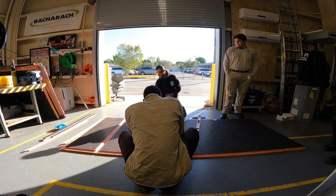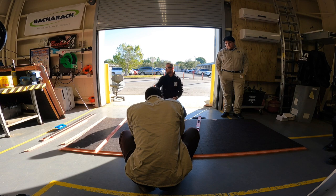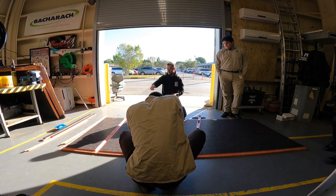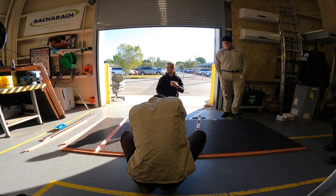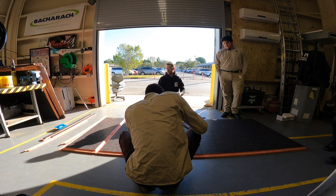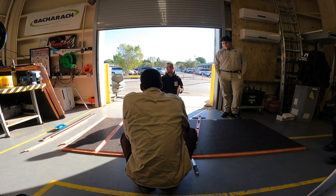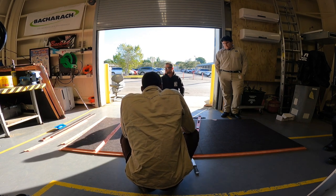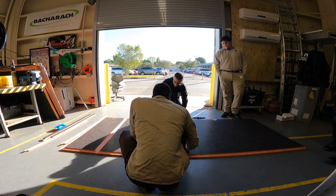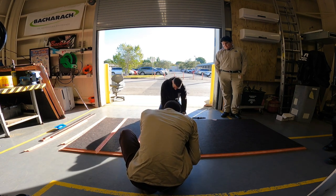Because we got a measurement on the outside of that beak, we need to make that cut first. You'll see some guys using a T-square, making all their scribes first and then making all the cuts at once. But doing it this way, cutting out so much math and extra steps — speed-wise it's probably a wash. It's just a little less mentally taxing.